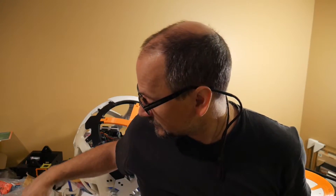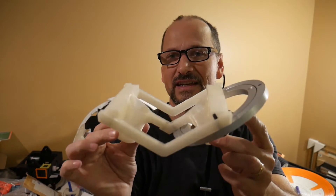I've been really working a lot with spinning — I have my flywheels and I've been working on some new alternate designs where the motors sit lower. The main thing I've discovered is the relevance of the weight of the sphere to how well it spins. With the flywheels, the flywheel has to have enough mass to counteract the weight of the body. What's really happening is the motors are spinning the body around a mass — the flywheels — that wants to stay still due to inertia. It's not really gyroscopic; it's basically overcoming inertia.